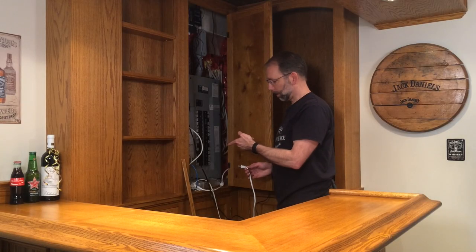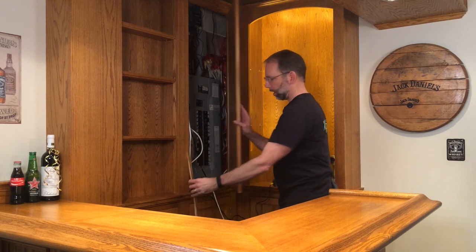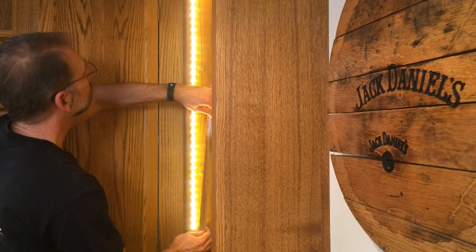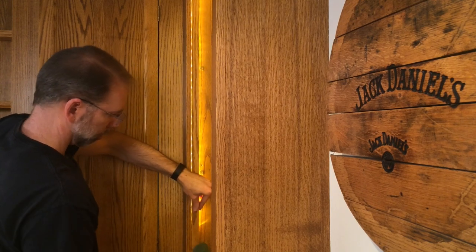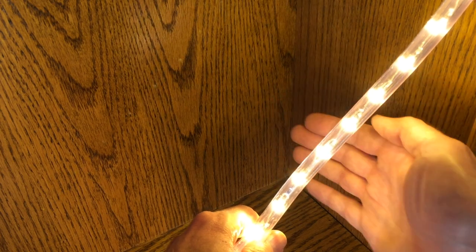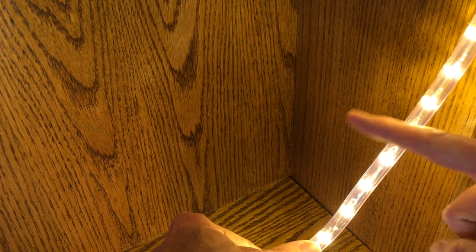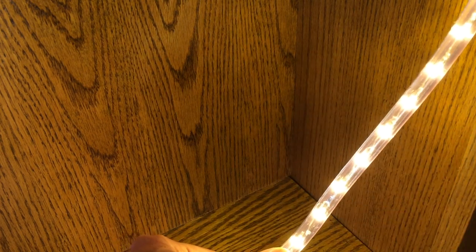Unfortunately, this string of lights has a shorter cord on it than the last one, so I have to use an extension cord on this side. I'll plug it in and that will allow me to see if this gable here has light gaps in it. I want to make sure I glue it in a way that it's nice and tight, so you don't see light between the front of the cabinet and the gable. With rope lighting, the lighting glows all the way around it. With tape lights, what you end up with is lighting in one direction — the lighting goes in this direction, with just a little bit of glow but mostly straight ahead. So that's why I prefer rope lighting, because you've got that nice gentle glow that provides a warm look to the cabinet.